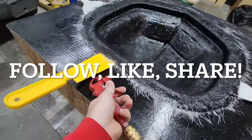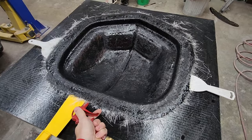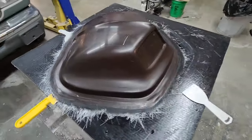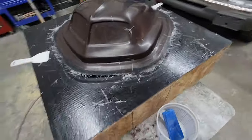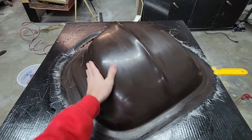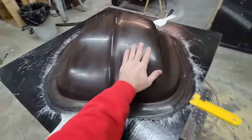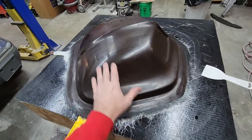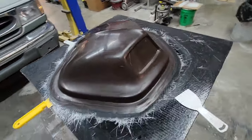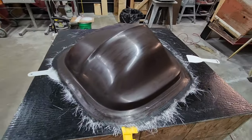I've got the air ready with a little separation where I put that wedge under, and I'm just going to fire air right in between the mold and the part. It just popped it right free — that easy. The part has a slightly dull surface finish due to two things: the PVA doesn't leave the shiniest surface, and our fiberglass mold isn't super highly polished. Since these parts get sanded and painted, this is a perfect finish. There you have it — step-by-step how to produce a part from a mold.